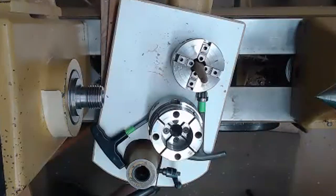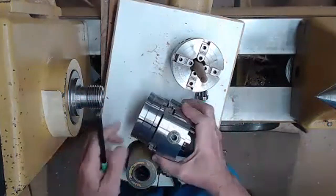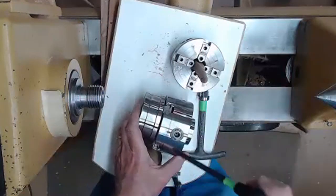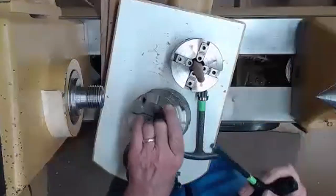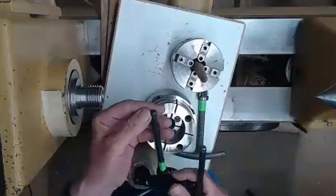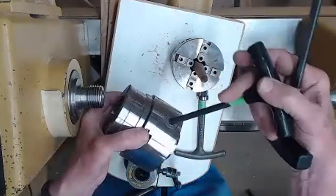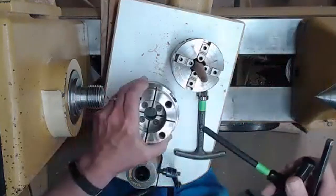That's one style. The other style, and best example, is Vicmarc and the Supernova 2 and the Record Power and the Novas and the Patriot. They use an Allen key, and they work very well. And the Nova and Record Power, and I think the Patriot, they come with a ball joint on the end of it that theoretically enables you to tighten it with it extended out to the side like this. So if you had a bowl on here that wrapped around, you might be able to get underneath that thing and tighten it. Frankly, I don't do that kind of turning.